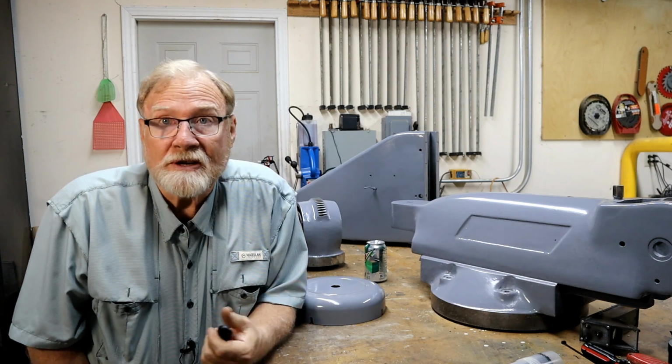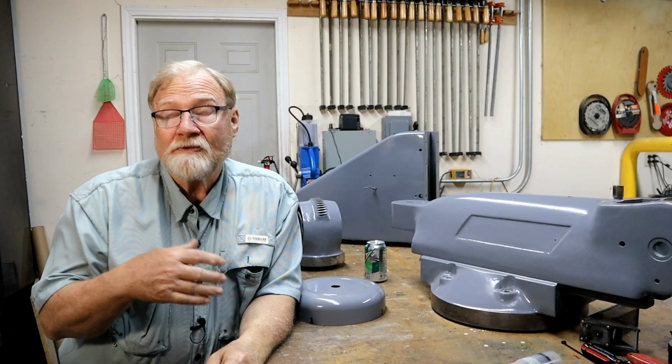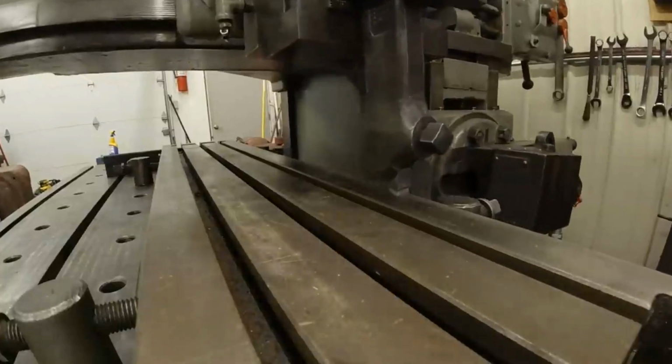We sit there looking at each other going, you know, how can we fix this? Well, Richard's got 7 hand scrapers in there, powered ones. Man, we could all do that. That was going to take so long. Richard told us the rule of thumb is if it's over 5 thousandths of an inch out, get it planed or ground.